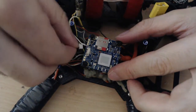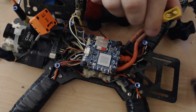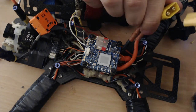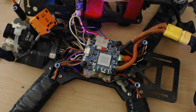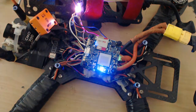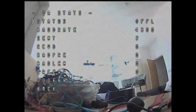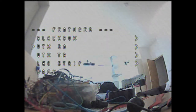We soldered that little pin and plugged the power back in. Now we're going to power up from BetaFlight to see if everything still works as before. We're going to try to use the OSD to change the frequency — and we can see right now that the smart audio is not recognized anymore. So let's try removing the pin.